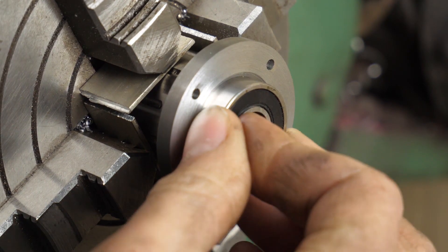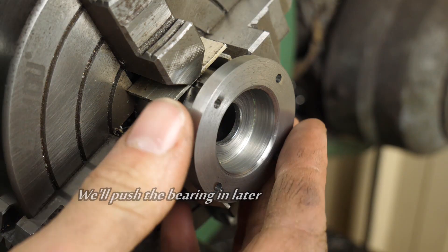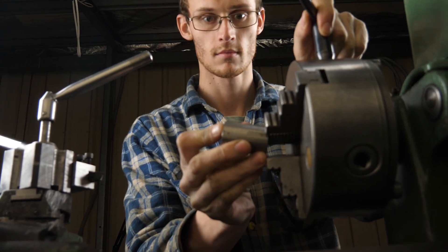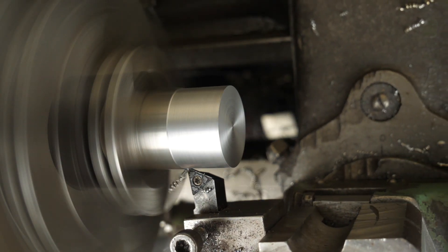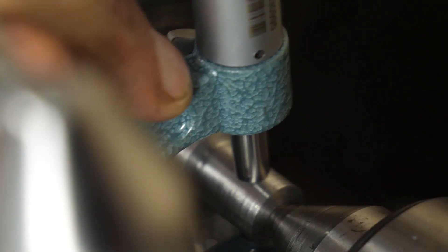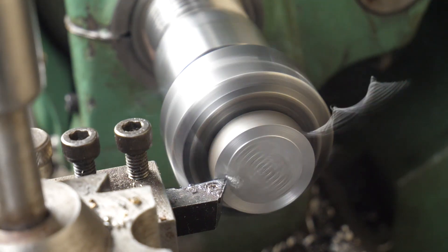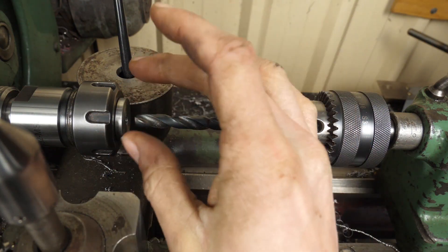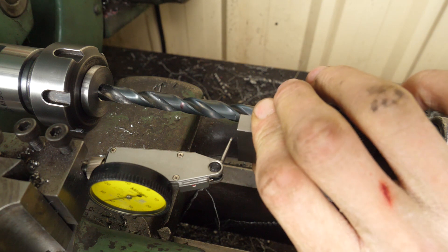That's pretty much wall to wall — I'm pretty confident I can push that in. I managed to hide the sleeve just by adding a heavy chamfer on there, which is also going to be good to push the bearing in. Now to make the spindle. I made the spindle stepped so it would fit through each row of bearings easier. It's very critical that the depth of this hole is very accurate — I need to measure how deep I'm drilling, and we'll use this gauge block as a distance to go.